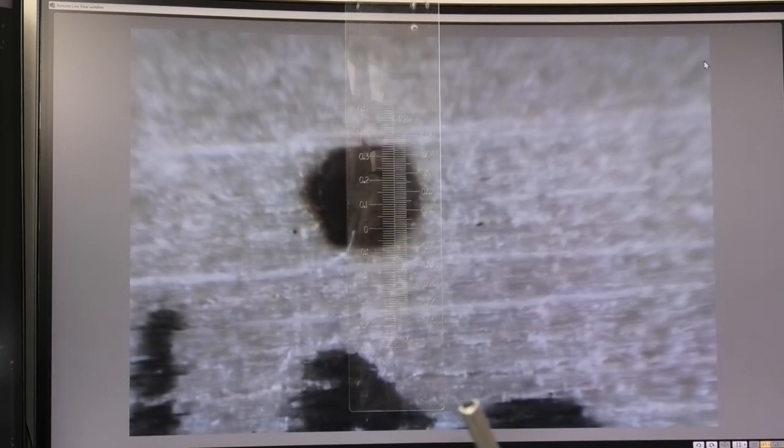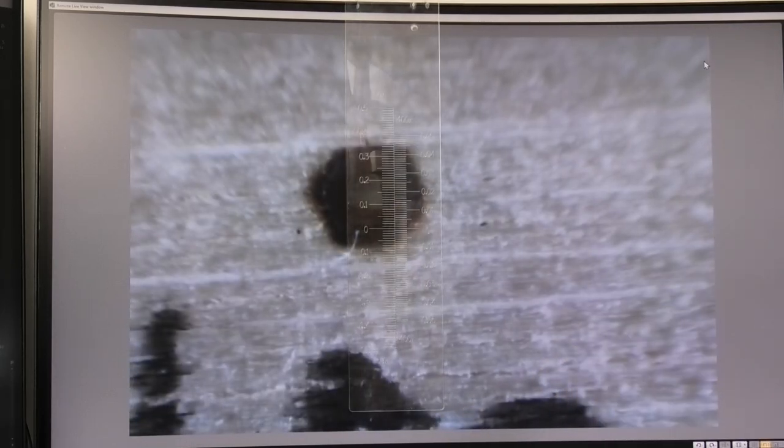Now here we go to 11mm, 12mm and 13mm. Now if we look carefully at 13mm, you'll see that it is, first of all, not very much browning around the outside. We've got a very distinct black hole here, which happens to be somewhere in the region of about 0.25. So that looks to be a better focal point than the focal point that the manufacturer specifies.